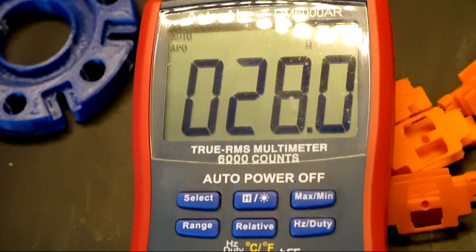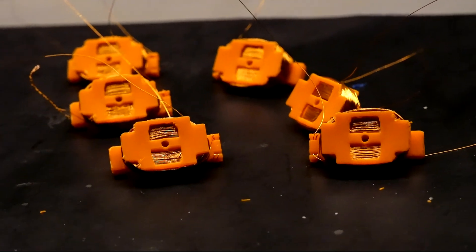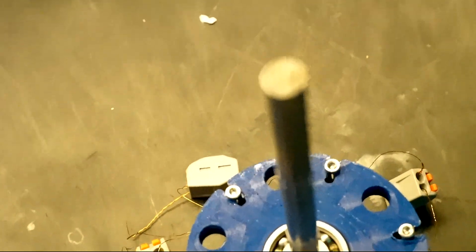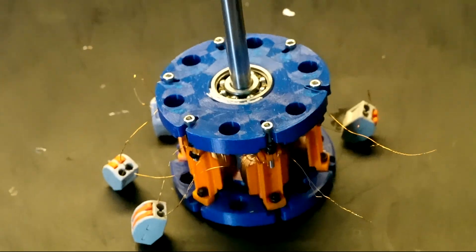After doubling up the ends and stripping off the insulation, the coils were ready to use. Moving to the rotor: my intent with this design was to reduce the overall height of the generator, specifically the stator coils, so that I could have more turns of wire with less overall wire length. This means less resistance, which means the coils will be able to provide more current as a result — see Ohm's law.